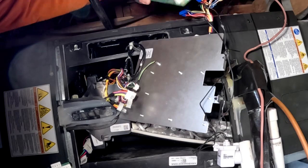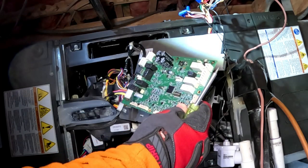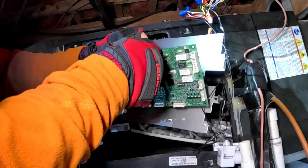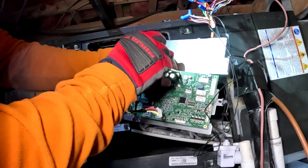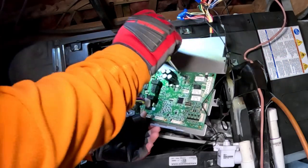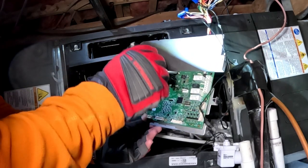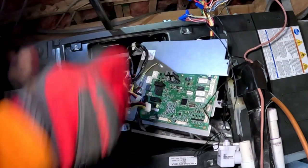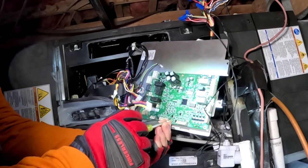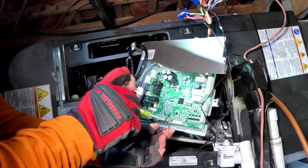Alright, I've got the old board out and put the new one in. Like I said, I don't think there's anything wrong with it — it's under warranty and it's install warranty on top of that, so it's not costing her anything. Just as a precaution we'll go ahead and pop another one in there. It's not going to hurt anything, and I don't think the old stepper motor being plugged into this board would cause any kind of long-term problem with the control board.